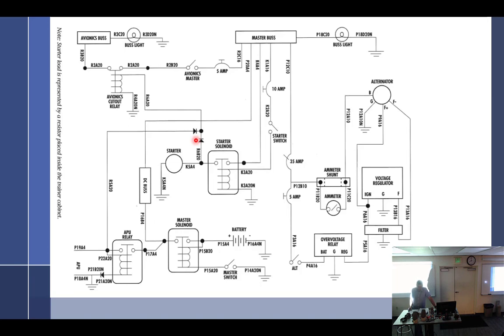When you're working with alternators, this looks very simple. You should see the wiring in my airplane. There are not 4 wires going to my voltage regulator. There is a wire loom going into my voltage regulator. There's a lot going on. You need to be very careful. You need to take photographs. You need to write things out because things go from real bad to really, really bad real quick when you start getting these wires mixed up and you start burning up alternators and voltage regulators.